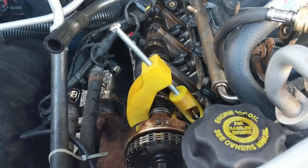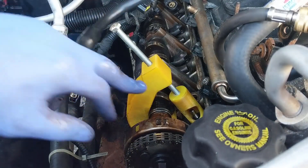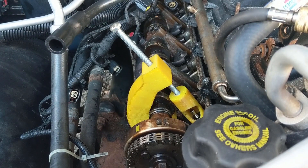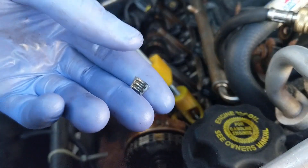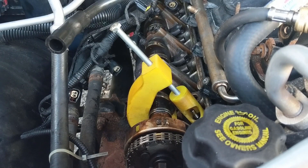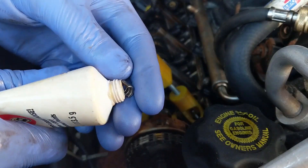I think this is compressed enough and you can see I'm not touching anything — it's very steady. It's not going to break. You have to print this with 100%, or at least 90%, infill, but it's super strong. The trick here is you have to put some grease on these keepers — either Vaseline or, in this case, I'm going to use some brake lubricant because that's the only greasy thing I have on hand. I'm going to take that and smudge a little bit on there.